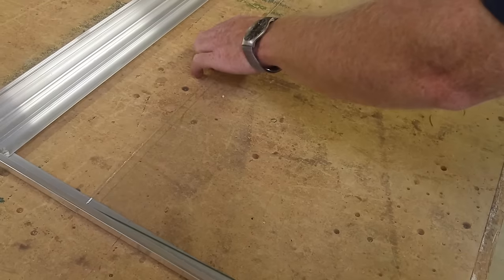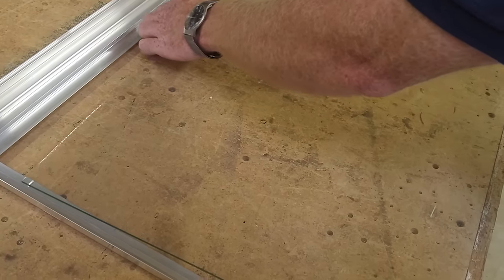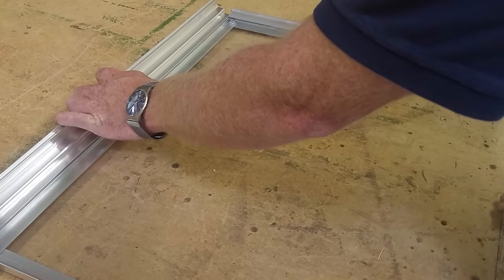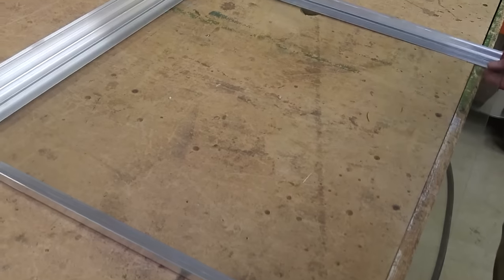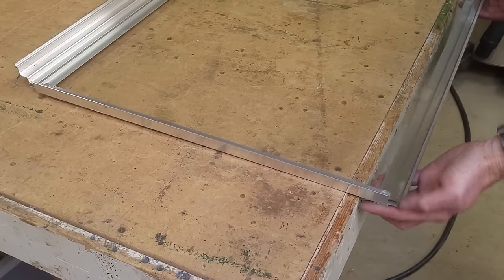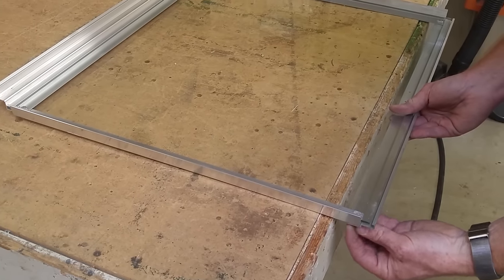The vent should also be built in your shop. And unlike the rest of the greenhouse, put the glass in as you build it. To do so, put together the top and two sides, then open the sides a little to slide the glass in. Once in place, close the sides and put on the bottom of the vent. Remember, you should have already put in the two bolts on the bottom of the side pieces in order to attach the bottom part of the vent.